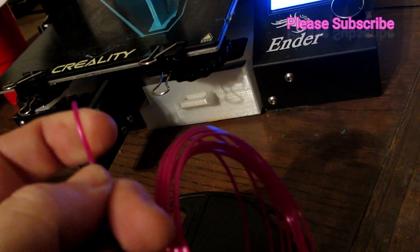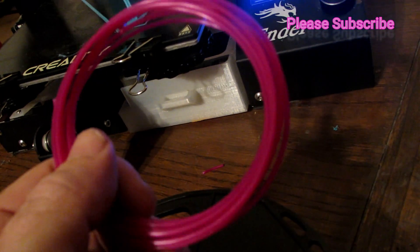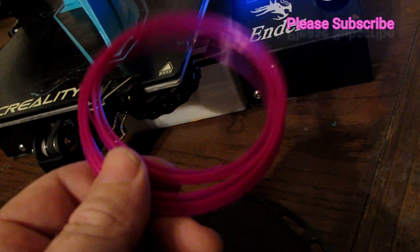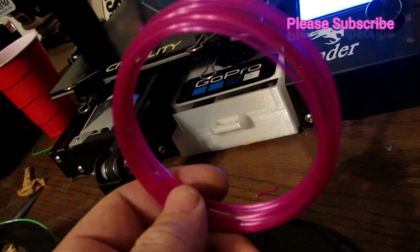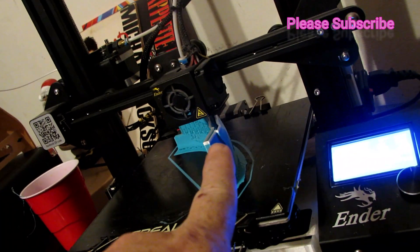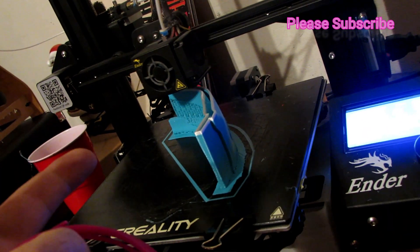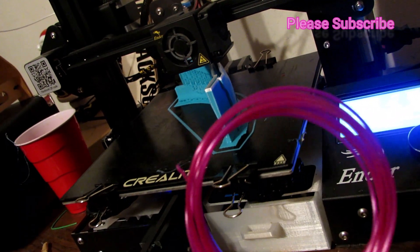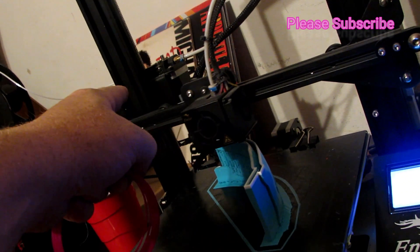All I've got to do is start bringing it back — it's really not flexible at all. Start bringing it back and it just breaks right off. You don't want to put something like that through your extruder and into your 3D printer. I've had this happen before, not realizing the PLA was just too brittle to run. What kept happening is I would print, leave the print, come back, and it would have a gap where it had just stopped printing. I thought maybe something was wrong with the extruder or it was losing heat, but no — it was actually breaking in the extruder. One piece would go as far as it could, and the other side wouldn't follow because it had snapped off.